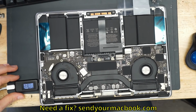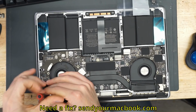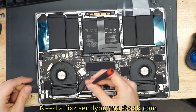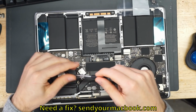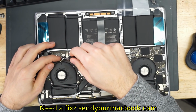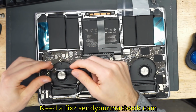So this is 5 volts, 0.01 amps. That's no good. Now, typically that tends to mean that PP3V3_G3H is missing, or that a CD3215 is not working properly. I'm not really sure which of the above it is. Not really sure what's going on with this, but we're going to open it and see. And I'll have all of you here to follow along with me. Isn't it fun to be able to follow along with me?